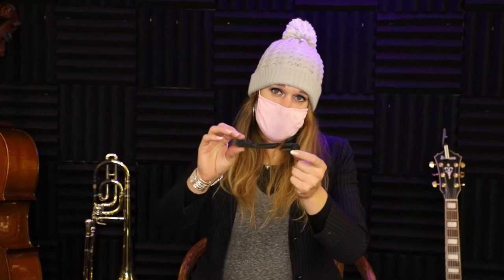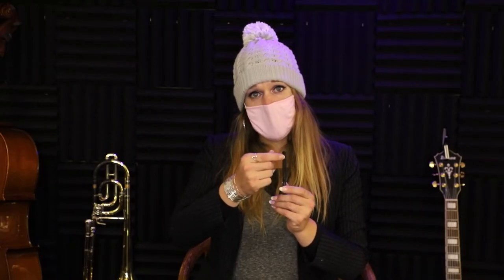Here is an example of one of the failed prints. This one stuck about two-thirds of the way, but then it started peeling back at the point where it was going to reach the hammer head. This meant that as I printed them in separate pieces, those pieces just don't fit together. So the first thing I did to get around this was a little 3D printing trick where you put a bunch of holes in the part to disrupt the straight lines. That helped tremendously, but I still got problems with that print being able to line up perfectly to a point where I felt comfortable with its ability to hold that joint under playing.